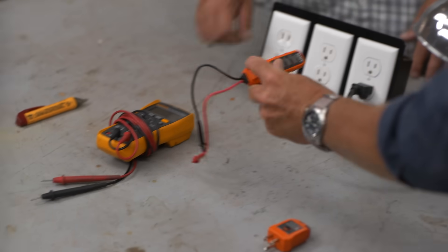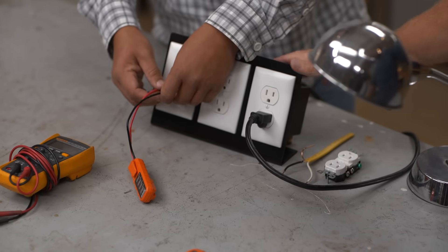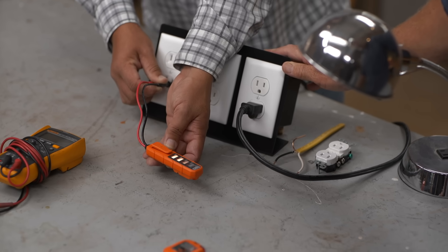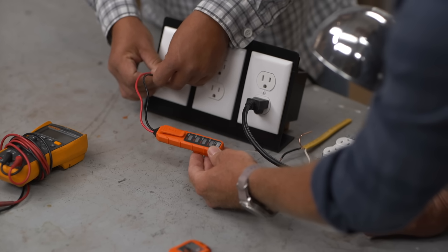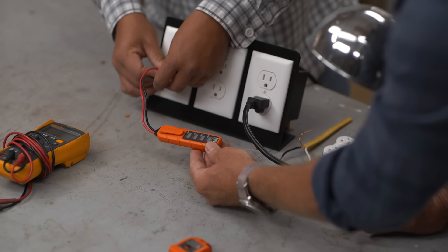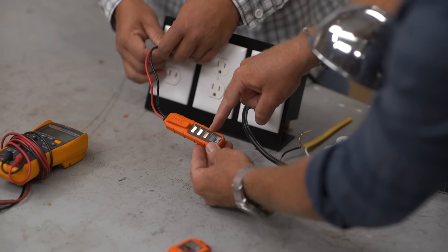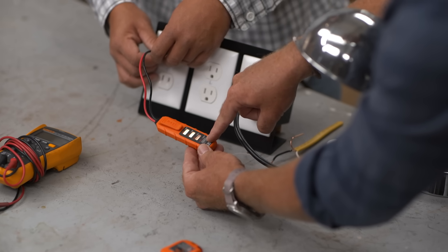Is this a simpler version? Yes, this is a simpler version. So how does this work? We'll take that and plug it in. When it lights up, it gives you several different levels to tell you what voltage is present. The lighting up tells me that you've got power. I'm seeing 24 volts, 48 volts, 120 volts, and 240. The first three are lit up, so that tells me it's getting 120 volts — yes, 120 volts, but not 240. That's going to help you know what that outlet, receptacle, switch, or whatever is getting for power.